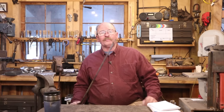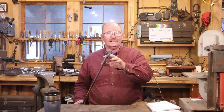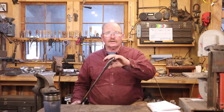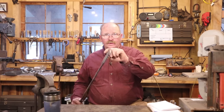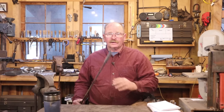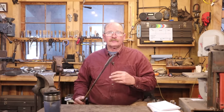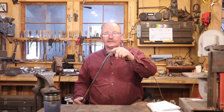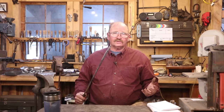So the fact that I was trying to just get that last little bit done without doing what I knew I should have done is what bit me - so let that be a lesson to you. Anyways, we've got a very nice chevron twist. The only problem is that little bit of delamination in the ring, which I can go back and fix. I've seen lots of versions of this - two pairs of bars like we did here, three, four all side by side, or four done in a perfect square bar pattern with one on each corner. Each pair you see are twisted in opposite directions. I kind of like the flat version like this - it makes a comfortable tool handle, a nice fireplace poker, or a nice fire tool for your coal forge. It would probably also make a nice hook back.